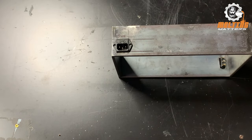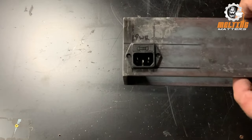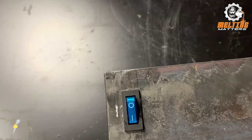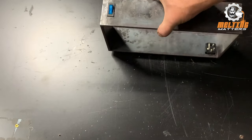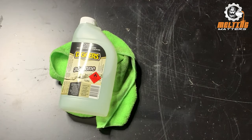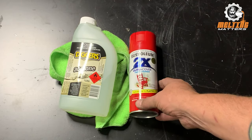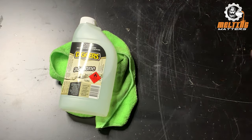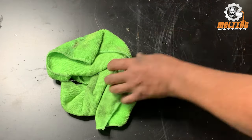You can use these types of magnetic vices on either an AC or DC circuit. I'll wire it up for an AC circuit including the earth to meet safety requirements, but I'm going to end up running it on DC — it'll give me a stronger grip. Running it at about 30 volts and 10 to 15 amps should give me a really good lifting force — it should be able to hold 500 kilos.